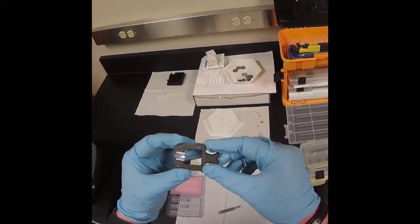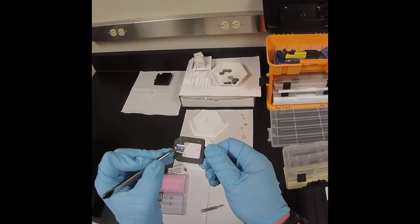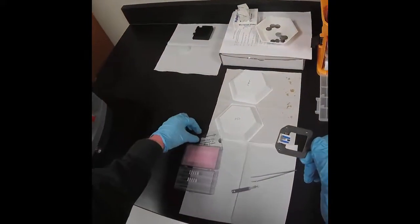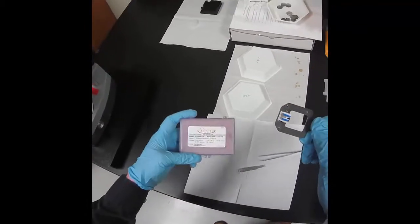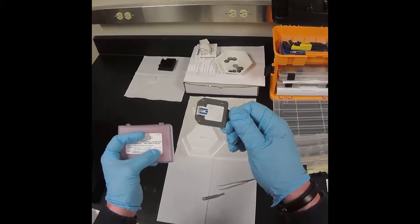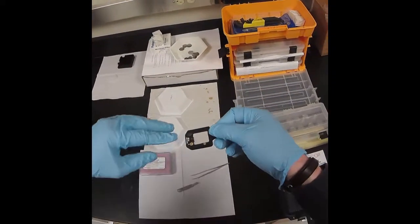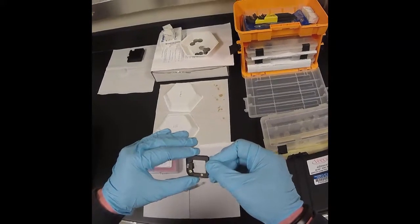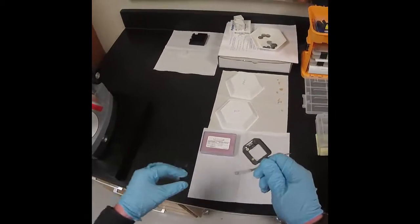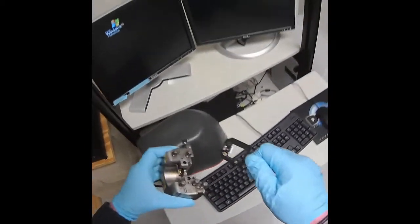It's locked in place. I do not want to touch this part at all. This shiny little trapezoid is the silicon wafer that's been etched. Off the end of this is that tiny little cantilever — the cantilever is about 100 microns long and 30 microns wide, so most people can't see it with the naked eye. That is the delicate part that can snap off. If we turn it over, this is the part that's going to touch the surface. You can see it has a shiny, reflective back because of the aluminum coating, which is going to allow it to bounce the laser in the instrument. So now we've mounted our pre-mounted tapping mode cantilever.